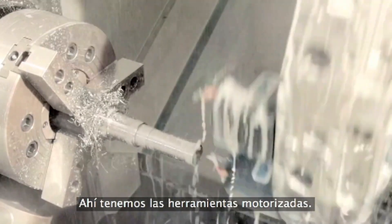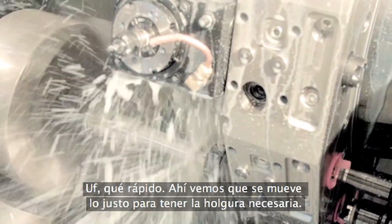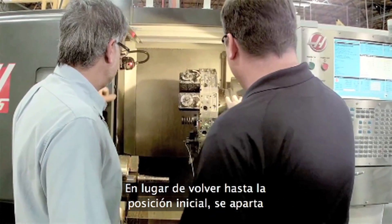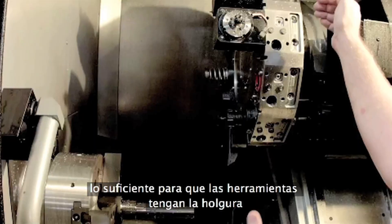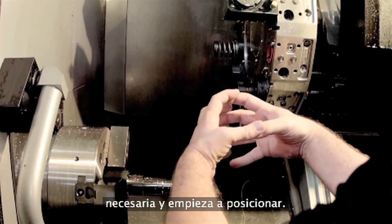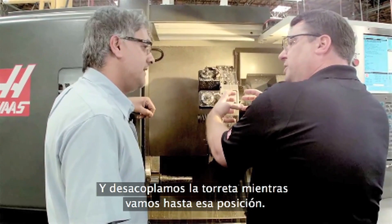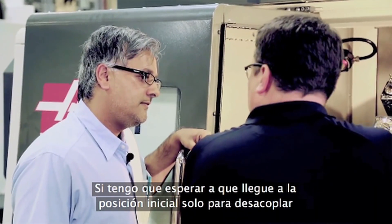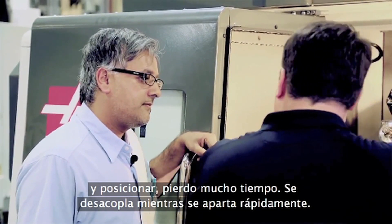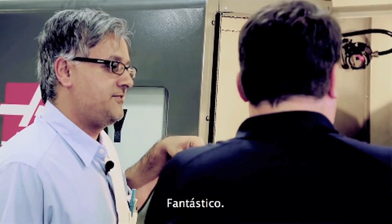Now we're running the live tooling — that is quick. You can see it just barely moves enough to get the clearance. What's happening is instead of going all the way to that home position, I come out far enough so that my tools will clear the part, and then I start indexing. I'm actually uncoupling the turret while I'm traveling to that position, because that's wasted motion — why not uncouple while I'm traveling away? That's all in a rapid move. That's fantastic.